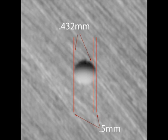As you can see here, I've scanned the plate on a scanner at 12,800 dpi — quite high — and we can see a much better enlargement of the image. The hole I made measures around 0.5mm. The ideal size I wanted was 0.43mm, but 0.5mm I think is close enough. The best way to do it is to put it on the scanner, bring it into Photoshop, bring up your rulers, and zoom right in. You'll be able to measure the hole much more easily than trying to use a magnifying glass and ruler.